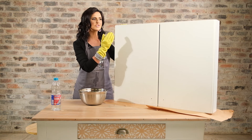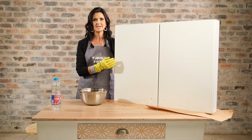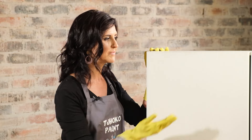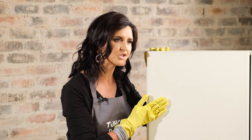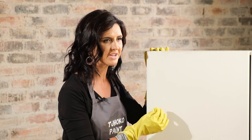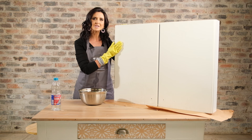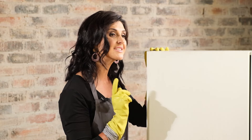It's very important to make sure that the thinners has evaporated completely. The next important step is to make sure that the surface you're painting on is solid and in good condition — paint won't fix cracks or imperfections. Your surface is the foundation for your paint that will be applied, so make sure it is in good condition.